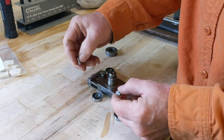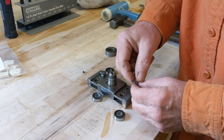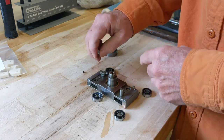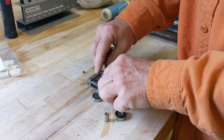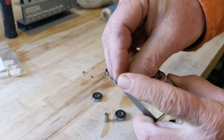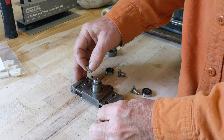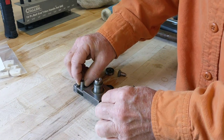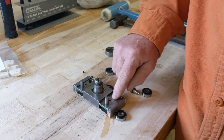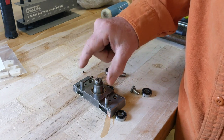These two pins are secured in place by these little set screws. They knocked these in and then secured them. If you notice, right there is a witness mark, and right there is another witness mark. Those witness marks were there before I disassembled this, which tells me these go in this orientation. Why that's important is these are knocked in — this hole is drilled and tapped with the pin in place. There's no way to get that pin in and get the set screw in if it's not in the right orientation.